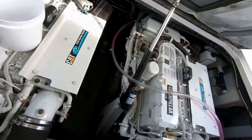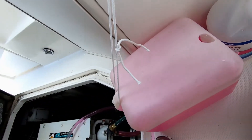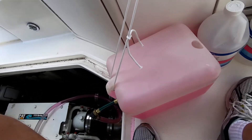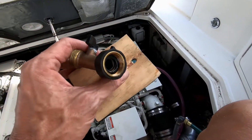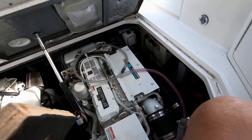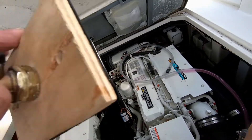I got the port motor connected up to my pink tank. By the way, I use a piece of string here just to tie it up because when it's close to empty and you're moving the hose around, it gets pulled in and you spill a bunch of pink in the bilge. I've got a smaller version for the generator and the air conditioner, which have a smaller strainer. This black stuff is shelf liner — drawer liner for kitchen counters. It's kind of thick and rubbery, so it makes a good seal.